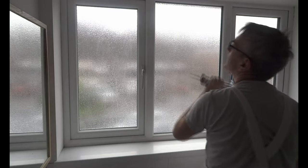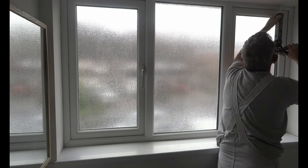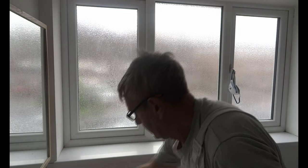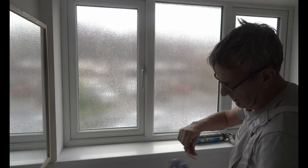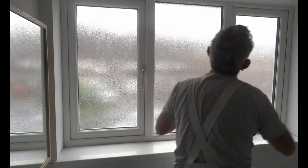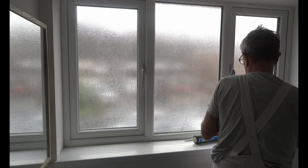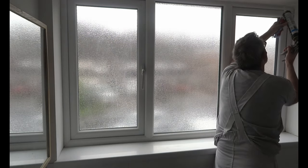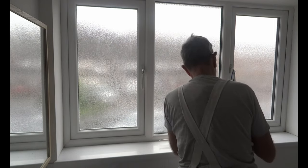So that's a successful run. I need a little tiny bit up there. If you're doing top ups like this, you must get onto it straight away. Silicone is totally unforgiving. Get another bit of cloth ready. Make sure you clean your adapter if you're doing this. Leave it more than two or three minutes and you've had it. It starts snagging and everything. She looks a right mess.